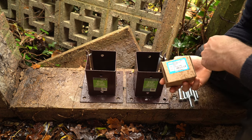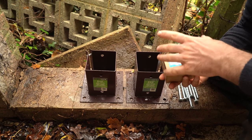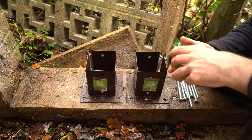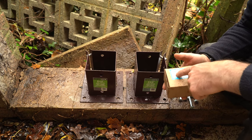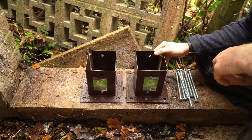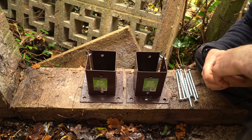Because this wall isn't quite flat and there's a bit of a slant, we're going to be using these M10 washers to build up the front side here to bring these bolt downs level — but I'll show you that later on.